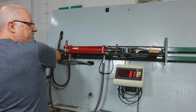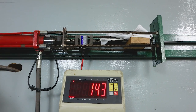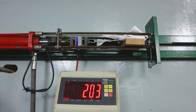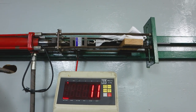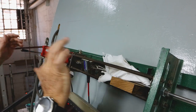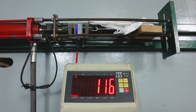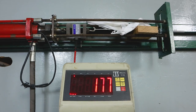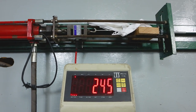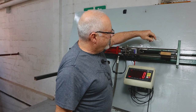70 kilos is all it requires for a 16mm band. 200 is about the max the mechanism can handle, so anything over 200 is good. Here we go — over 200. Let's move it to the second one. Already at 100 — let's keep going. We have had these over 300 already. I don't know exactly what that broke at, but it was well over 200. It did haul the pin off.